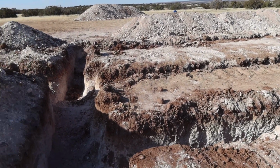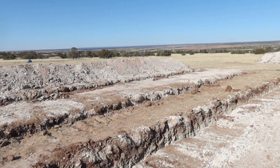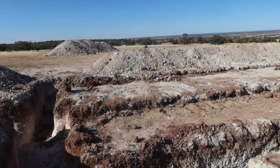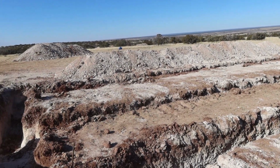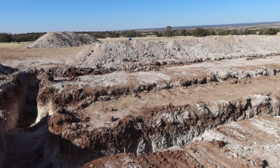And that has to be perfectly level the entire length of your trench. The reason why is you don't want a drop in your line and have all that liquid down at the end of your field. You want it to be able to absorb over all that length. This is way overkill, but I have the space and I get to use cinder rock, and cinder rock is cheap. Corrugated pipe is super cheap.